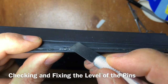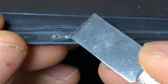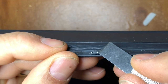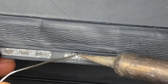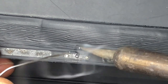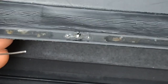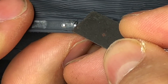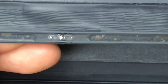That's all stuck down — not 100% as good as the original, but good enough and flat enough. The other thing worth fixing: some people have reported that the middle pin sits lower than the outer ones — they're spring-loaded pins that make the connection between the keyboard and the iPad. My one was sitting too low; I've already tried adding a little bit of solder onto it and it still sits a little bit low. So I'm going to add a little blob more — you don't want to melt too much of the plastic around it, so be quite quick. That now sits a fraction too high, so I'll use a scalpel or a bit of sandpaper just to shave off a little bit of solder off the top.